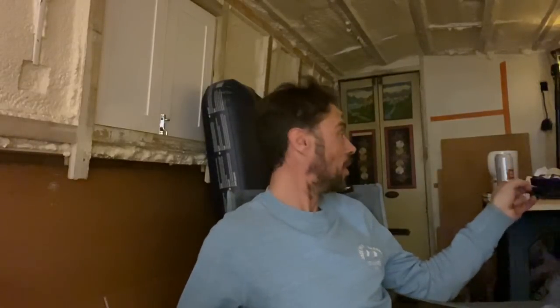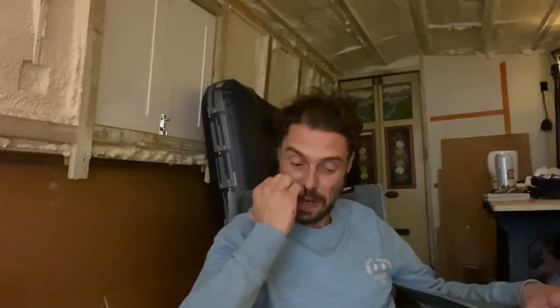I can't really build a dinette because then I've got nowhere to work, so I'm going to have to keep certain things going. But all of that stuff on my temporary galley can just turn into my galley. At the moment it's about electrics and water and gas — that's literally it. So I'm going to carry on with the plumbing. My next step is to do a bit of cutting away to make sure I can get my pipework underneath the floor into the bathroom, and then start laying the pipes down the port side of the boat.